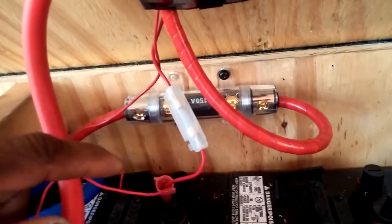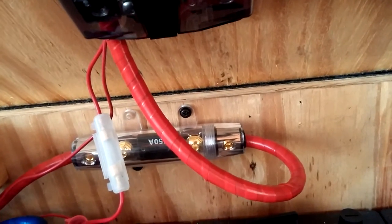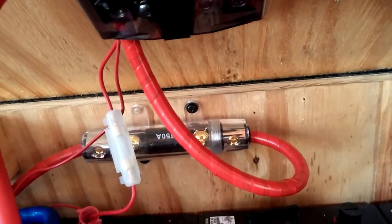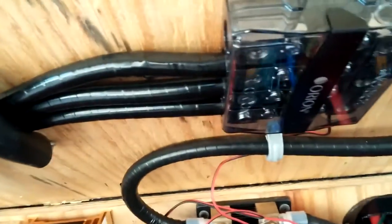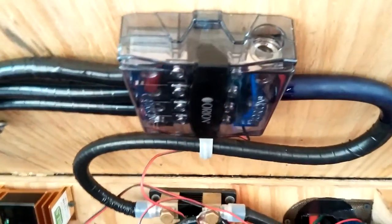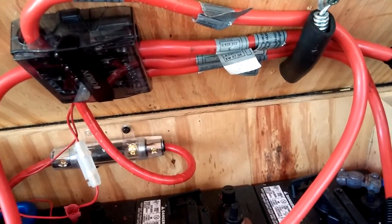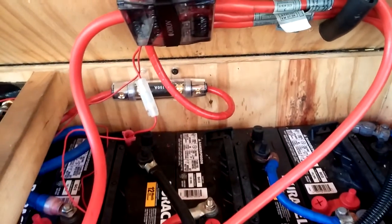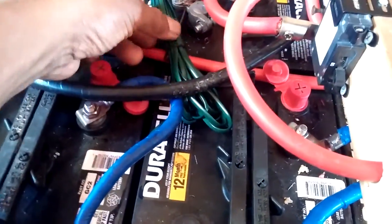Over here we also have low voltage going into the house. We have a 150 amp low voltage fuse that feeds the house for certain low voltage things. And that's my battery cable — all my battery cables are at equal length. I'm running zero gauge wire straight across, with all cables from the battery negative side to that bus bar at equal length, same thing on the positive side.